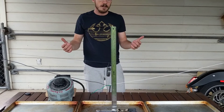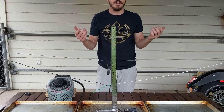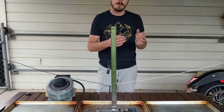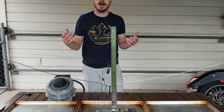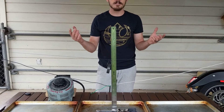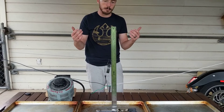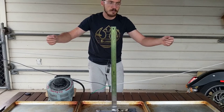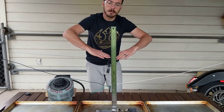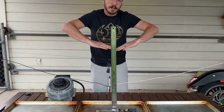So what's happening here? Because this is a piece of iron wire, at low temperature the phase of iron is what's called alpha iron — it's ferrite. The atoms come together in a certain way which we call body-centered cubic. But at high temperatures, as the atoms get hotter and hotter, all of a sudden there's a reaction that takes place: they go from body-centered cubic and transform into face-centered cubic. In that process there's a volume change — the atoms in face-centered cubic are more tightly packed together. So as we're heating this up, it's thermally expanding, which is why the wire is initially getting longer. Because the wire is fixed at two ends, if it's getting longer it droops more and more. But all of a sudden, at a certain temperature, it reaches a point where it switches to FCC and it shrinks because the atoms snug closer together, so the whole wire contracts.